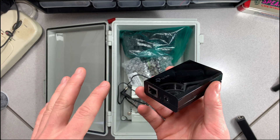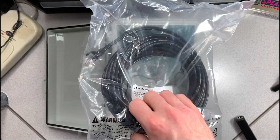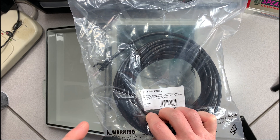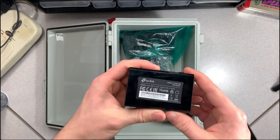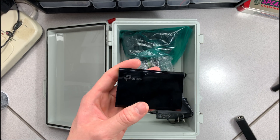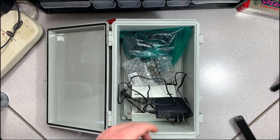I have an initial cable — I think it's 40, 30, or maybe 50 feet — running from where my router is to where this will be mounted. From that point I have this cable, which is RJ45. I bought it in black because black has a UV-resistant coating — other colors like white and blue will actually degrade and fall apart. Thanks to the Crypto Lab folks for that tip. I've had really good luck with TP-Link — I've used them for wireless adapters for my mining rigs and network switches.